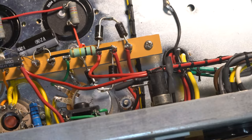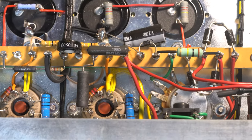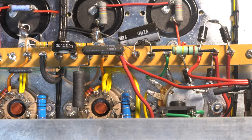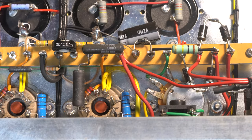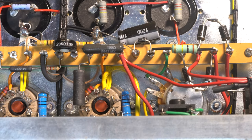So I've got that hooked up. What I'm going to do is step back to the distance view. One of the things the customer asked about is that it's getting hum with the reverb on — if I recall correctly — and I heard it definitely. I'll have to see if I can reproduce that, but I'm not going to plug it to a speaker right away. I'm plugging it to a dummy load because I just want to get a sense of where things are before I go further.